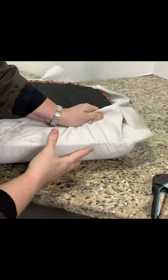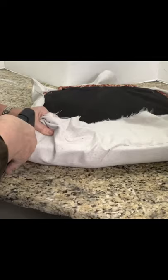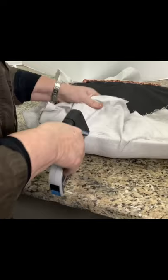That's a wrinkle that was in the material. So I've got this one in and this one in — I'm just going to come in the middle of those two staples, put it in, then in the middle of the next two, and in the middle here. Just keep easing all the way around. Now here to here — I've got a staple in here and a staple here. So I'm going to find my corner better, and then ease in the middle and ease the whole thing all the way down.